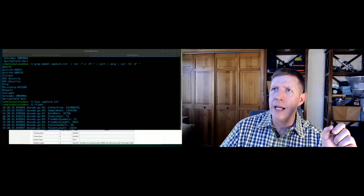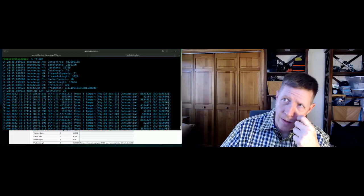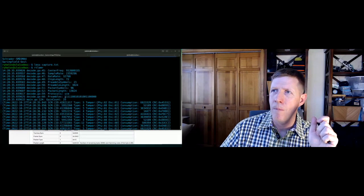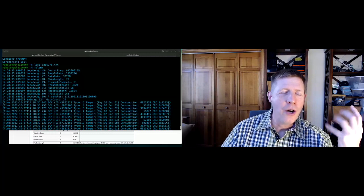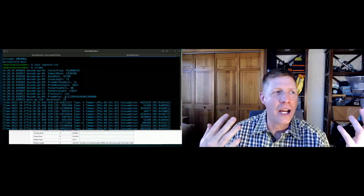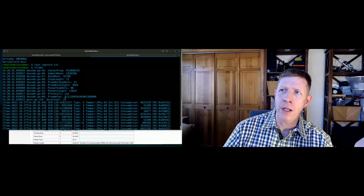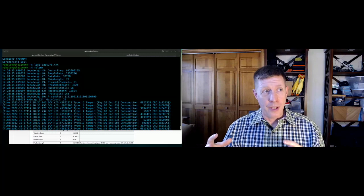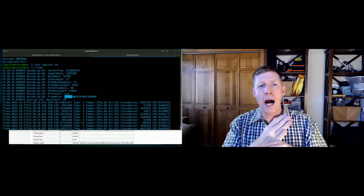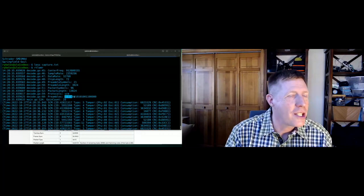But it looks like this. So you've got all of this stuff, data rate, sample rate, all of that. You have this thing called a preamble. A preamble is when a radio turns on, they don't know what speed they're operating at. It's like, hey, are you using the same clock as I am? Probably not. So you'll see this a lot: when the device turns on, it gives you this 1 1 1 1 1. So it goes on, off, on, off, on, off. And then the receiver uses that and says, oh, I can judge what speed you're on. So when you see 1 1 1 1 1 at the beginning of a message, that's a good thing.